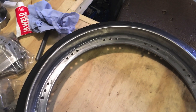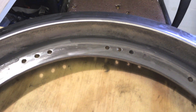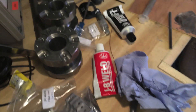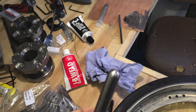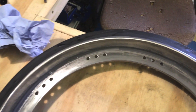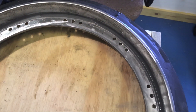I've done the fillet round the edge of the T-ring. I've just done that with this JB Weld stuff, and then they supply you with a tool to round it over. So I've just got to wait for that to go hard now, and then I can sand it.